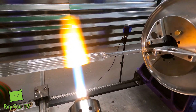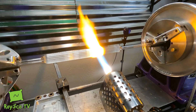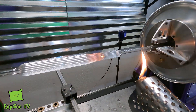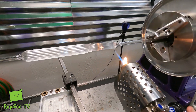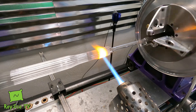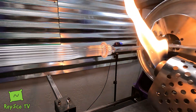I don't want to go too skinny though, because if the neck of a piece is too skinny that's often what causes the straw effect where you're sucking up water when you go to rip it, and nobody wants a mouthful of bong water. I'm going to throw a little splash guard in too — I think those look really steezy, especially with the Contrax. It's a good way to show off that tubing effect. I'll pull just a little bit longer. I will do a maria at the top as well, so that's why I'm pulling down so much — the length is going to drop dramatically when I do that maria. This side will be the top of the neck where I'll make the maria. I'll focus the heat on one section, get that glass ripping hot, then roll the blade chucks together and it'll flare out the glass to make what we call a maria.